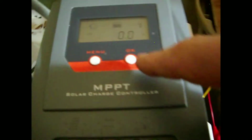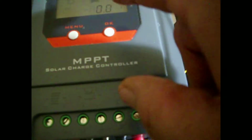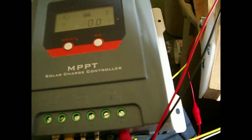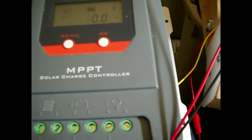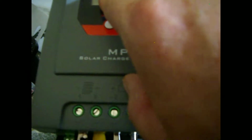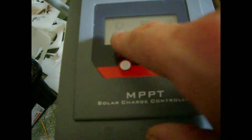It's got some really intricate push button sequences to go through the menus. I know it's doing the MPPT algorithm, because it gets really hard to crank, and then it lightens up, and then it settles somewhere in the middle as far as torque at the input. If you stop cranking for too long, the sun turns to a moon, so it thinks it's in night mode.